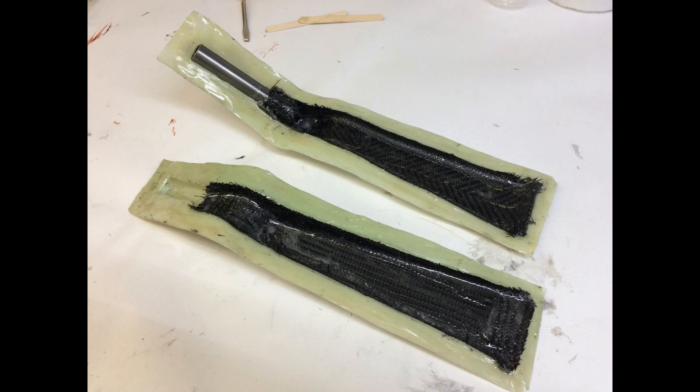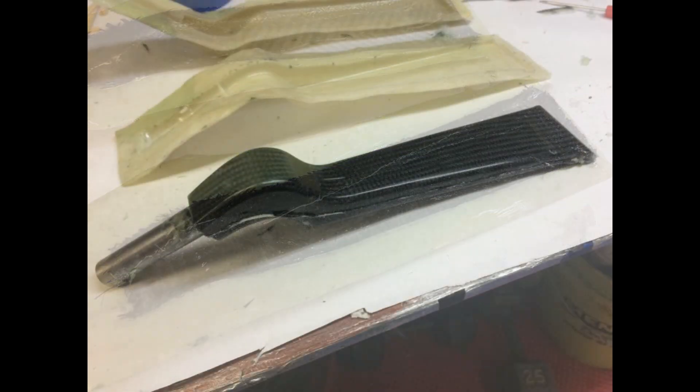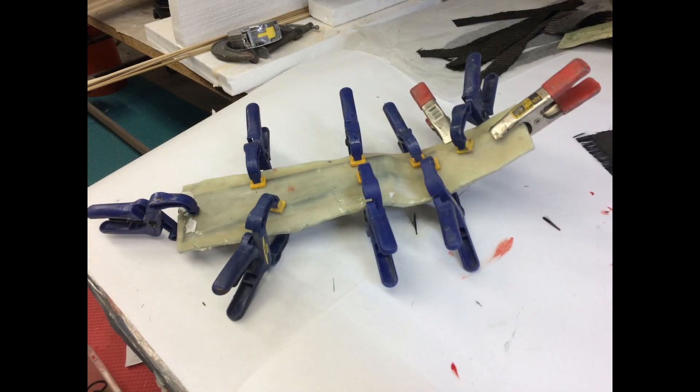The original plans show plywood landing gear struts for this, but I wanted to do them out of carbon fiber because I love working with it and if you do it right, it's super light and super strong. You just can't throw carbon fiber on something and say it's going to be lighter — you've got to understand how to use it. There was a front half and back half with a little lip around them, so when I sandwiched them together in epoxy they would stick together, and it worked out perfectly. They weighed virtually nothing when done — I was so excited with how these turned out. They felt like they had helium in them.